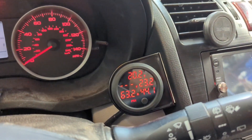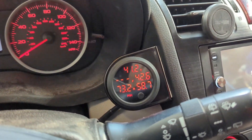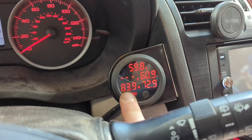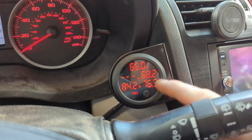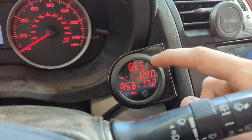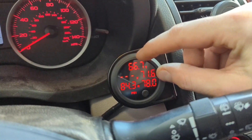Working like expected: this is pre-cooler and pre-filter, this is post-cooler and pre-filter, this is near the AccuSump so post-filter, and this is the air pressure — it's going to match the oil pressure going into the AccuSump.